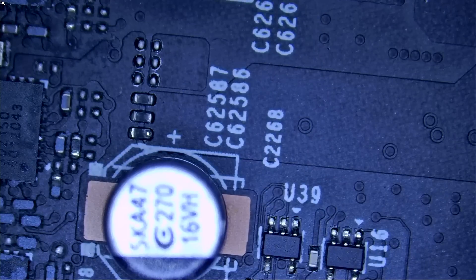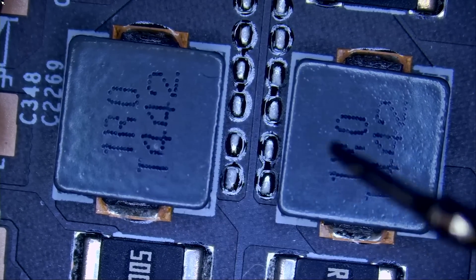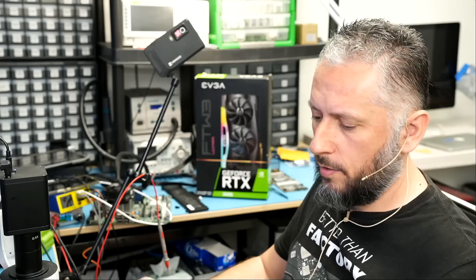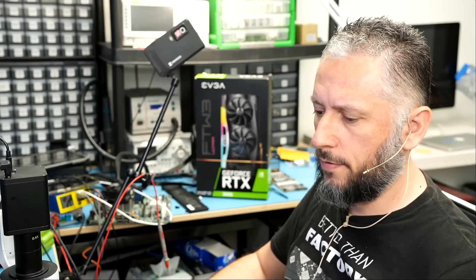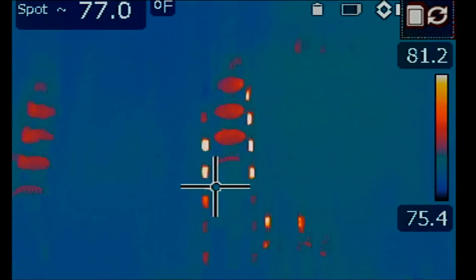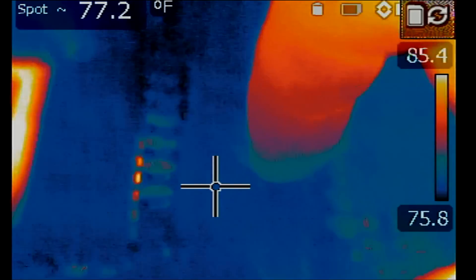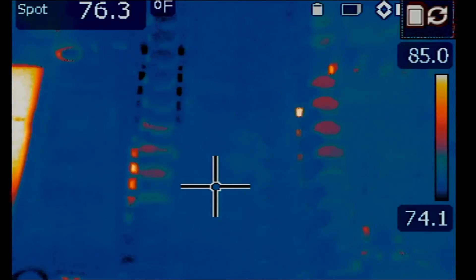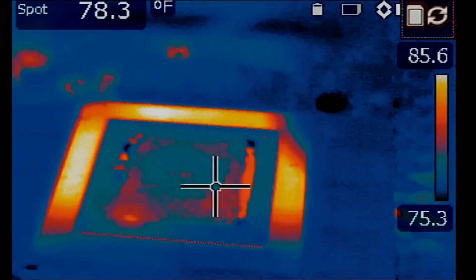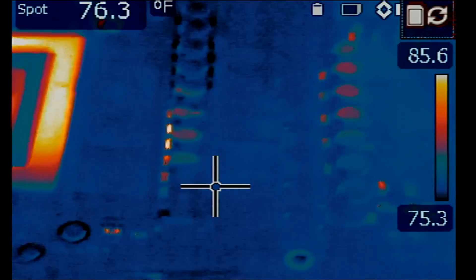What we're going to do is inject voltage at one of the shorted coils and monitor the board under a thermal camera to see what gets hot. It may be difficult to see because the board is very thick with a lot of thermal mass, but we'll focus on the DR MOSFET chips. Those are the capacitors, and right next to them on the left are the DR MOSFETs. Let's inject one volt and see what happens. That's our GPU right here, and there's slight heat on the GPU.